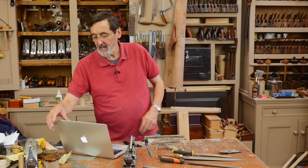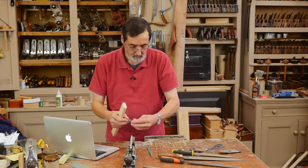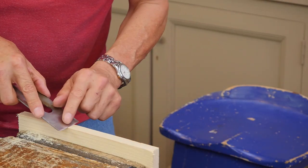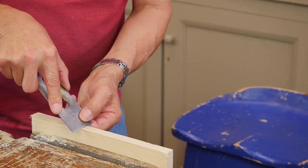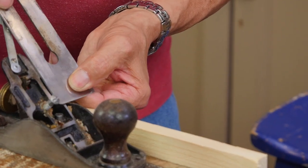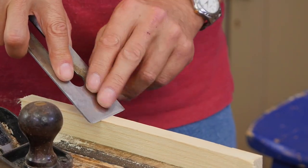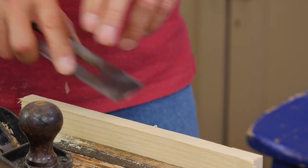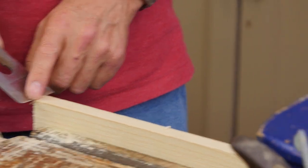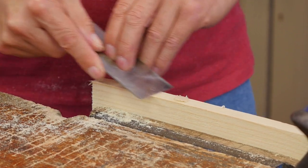But when I push it on the end, give you a visual on this. If I take the iron on here, let's say that I now have a much steeper bevel. The bevel is up here. So when it's actually offered in the plane, it's offered at this bevel here of 45 degrees when it's offered to the wood. But the problem is it's rounded this edge, so the bevel is not actually hitting the wood. The cutting edge is not hitting the wood. Whereas when I start back here, it does hit the wood. So it's taking that initial shaving right at the beginning, but then it's riding the bevel the whole time.